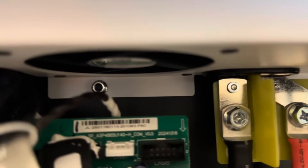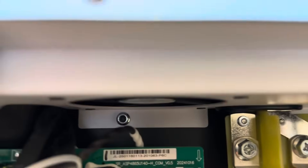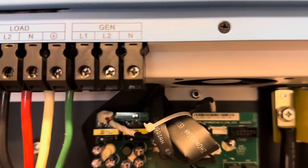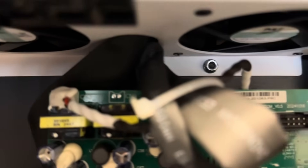The cooling fans are on right now with no load — just idling. They run at low speed pretty much all the time around the 80 degree temperature range, so just be aware of that noise level. How much air do the fans move on low speed? I'll put a paper towel up against one of the filter grates at the top — one of the intakes — and see if it holds. Pretty good airflow considering the other vent is wide open. It is holding that paper towel on there nicely.